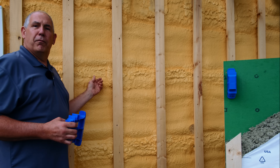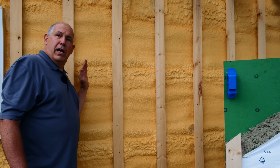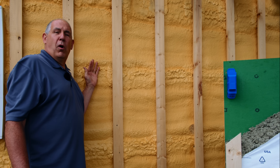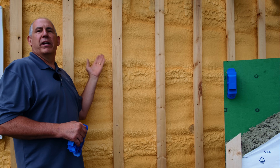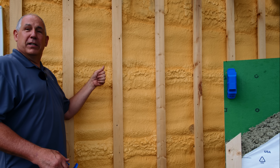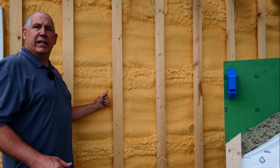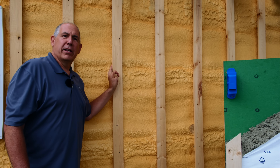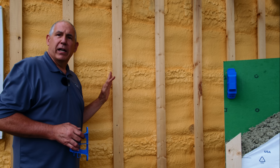When you talk about durability for a homeowner, if you get a hurricane through here and it rips your siding off or your roof off, you're still watertight in that event. And there's no loose edge of plywood to catch the wind and flip off. Like the tornadoes where you see one piece of sheathing come off and then the next and the next — this is stronger and prevents that. Even the creaking and the moaning — you've made your wall so much stronger by adding the foam, and it spreads out the load. The science behind it gives you so much more performance, durability, and health.